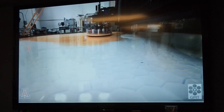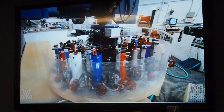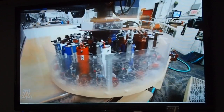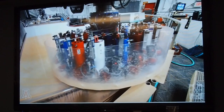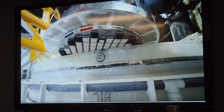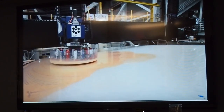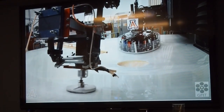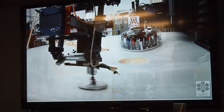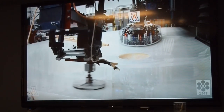This requires a lapping process where we remove glass selectively by rubbing a disc across the surface. The large stressed lap is a stiff tool that changes its shape to follow the variations in curvature from point to point across the mirror surface — it smooths out small-scale ripples. The smaller laps are primarily for figuring rather than smoothing. We lap longer on the parts of the surface that are too high, bringing them down to match the rest of the surface.